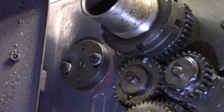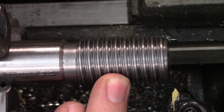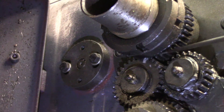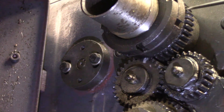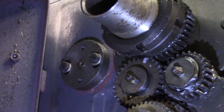In this case, factors of 40 teeth allow 2, 4, 5, 8, 10, and 20 starts. The disadvantage is this is by far the easiest method to mess up — if you are off by a gear tooth, your threads will not be spaced correctly. You can do a quick idiot check by making sure you have the same number of teeth between the starting tooth and the second tooth as you do between the second tooth back around to the beginning. If you are cutting more than two starts, you can mark out which teeth you will use beforehand, but you need to make sure that each of those teeth starts out meshed with the same spot on the mating gear or the thread spacing will be off.